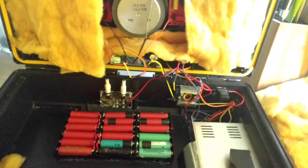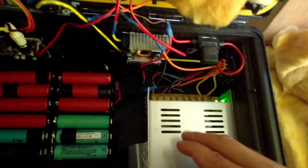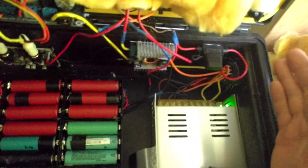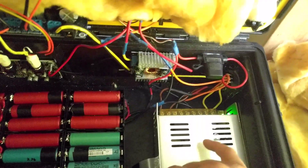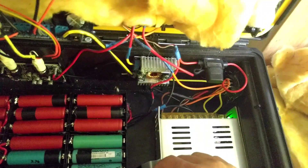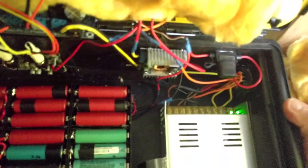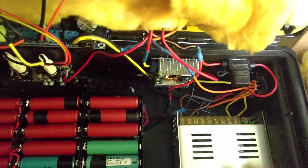I'll demonstrate the issue here. So if I power this from the wall without actually being plugged in, then it's backfeeding that power into here, which is fine because it'll be plugged in when I have it set to that and it will instead charge these. I could have solved this with a diode and stepped up the voltage a bit more, but I just didn't want to deal with it — I was much more satisfied throwing a switch in there. So if I kill the power and supply the amplifier from just the batteries, you can see there is no more backfeeding of that voltage.